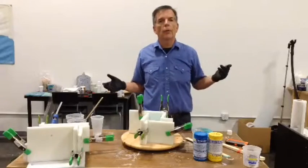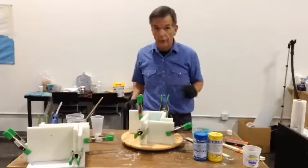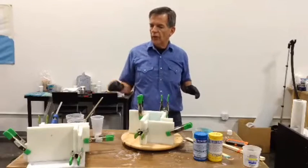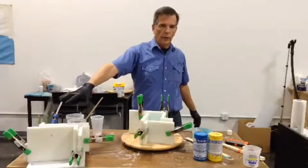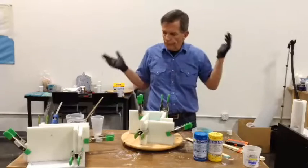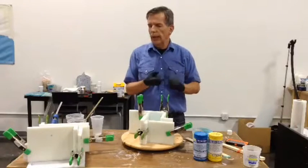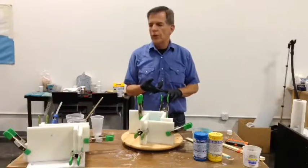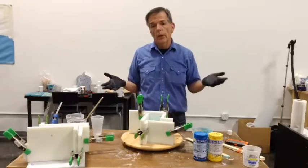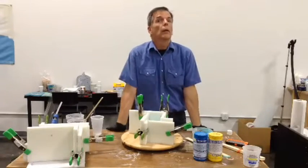What time is it? 12:19. So in the course of approximately 19 minutes — and that's assuming we started on time, which I don't think we did — look what I did. The most important thing was you watched me strip a mold that had already been set up and cast the first half of a two-piece mold. If you jammed 30 minutes in between there to let the rubber cure, now I'm at 49 minutes — roughly 50 minutes into a mold-building project — and we're basically ready to pour the second half.